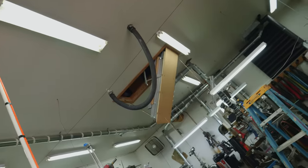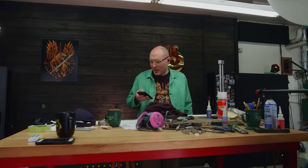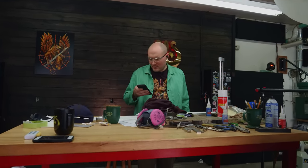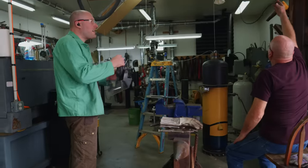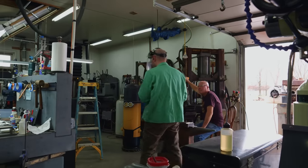What temperature, Dad? 815, which is 1500 degrees Fahrenheit. We're doing Celsius because the controller apparently only goes up to 1100 degrees Fahrenheit, but it'll go up a lot higher in Celsius for some reason. Maybe its digits can only go up to 1100. We're probably good to take it out. It's been 3 or 5 minutes now, huh? Okay, go.